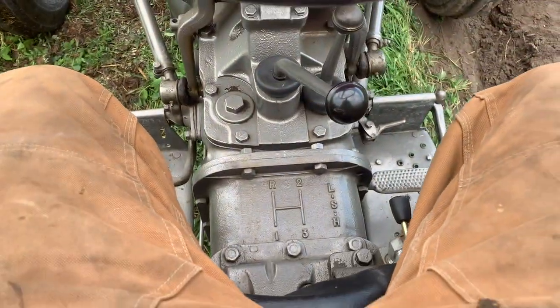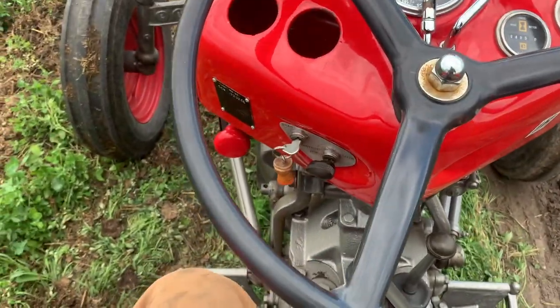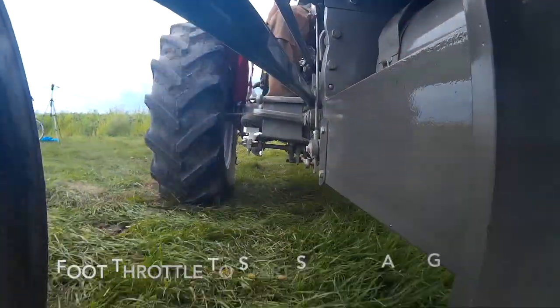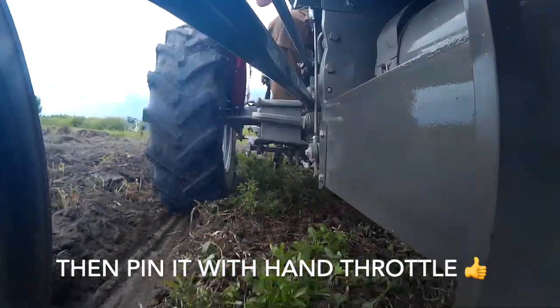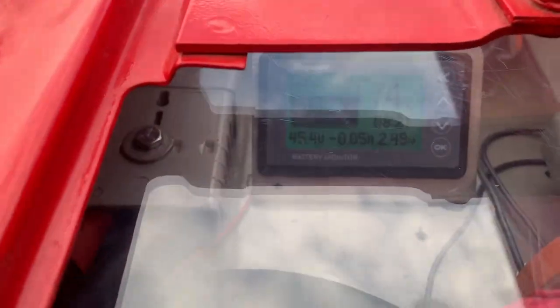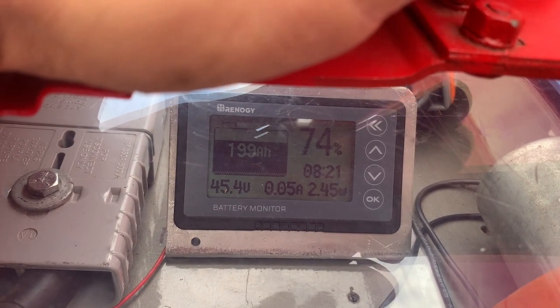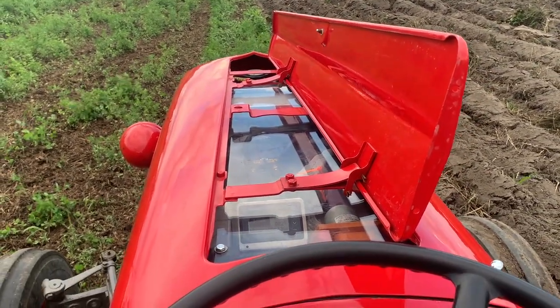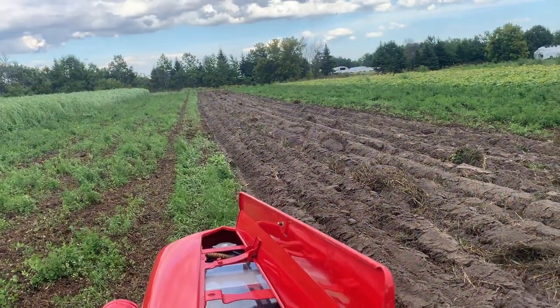I love the way Samuel programmed this so that the motor spins down to zero, because it means I don't have to use the clutch if I don't want to. I can just use that foot throttle — it's connected to the hand throttle. I've been watching my power gauge and mostly it's been plowing, pulling these two bottoms in high one at around eight kilowatts. So I'm going to see what it does with the motor spinning faster, ground speed a little lower in high three, hoping that'll evacuate a little bit more heat.